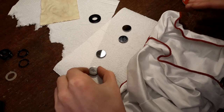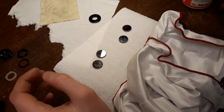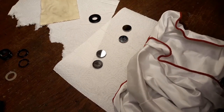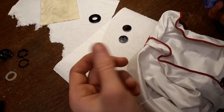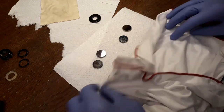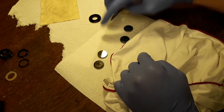And I'm going to use these mirrors from the previous laser cutter, and you may be able to see that they are pretty dirty, for laser mirror standard. Before we get started, I think I'm just going to clean these up using some stainless steel cleaner, which should get rid of all the dirt and fats that are on there from just touching it. And because of that, I'm going to use some gloves. Okay, here I am, back with the gloves, and I'm just going to use this towel, which is made for, I think, wine glasses. And yeah, we can't use just this because this might scratch it up.